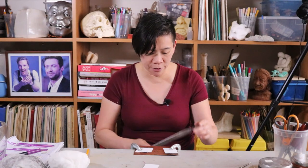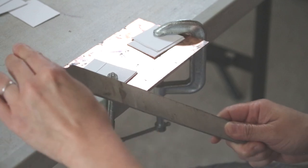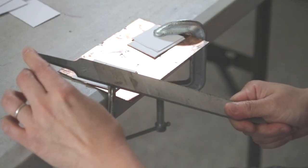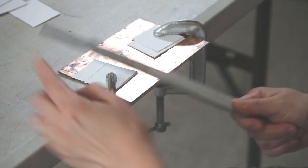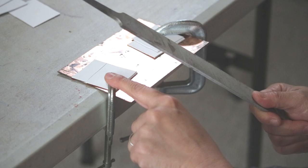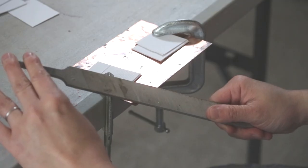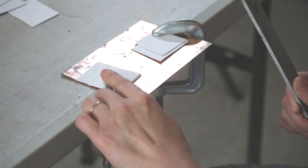Let me just check with my file to make sure this is far out enough. I have to pull my plate a little further out. I could tell because when I was holding my file at the angle, my file was touching the C-clamp, and you don't want that to happen. That's a lot better, because now when I'm holding the file, I'm not actually touching the C-clamp.